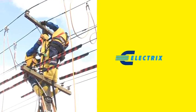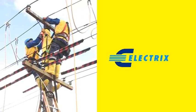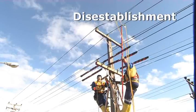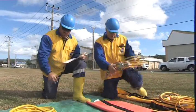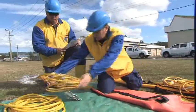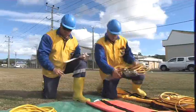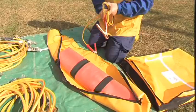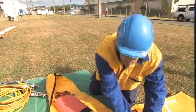The Electrics Equipotential Bonding Solution is a quick and effective way of mitigating the risks should a single-phase livening occur. When all the work has been completed, we check in all our gear used for the earthing. The set-up can be dismantled in the reverse order of application: first bonding leads, then shrouds, then earths. Once all equipment has been returned to ground level, and before the access permit is cancelled or returned, all equipment must be checked in to ensure that nothing has been left aloft.